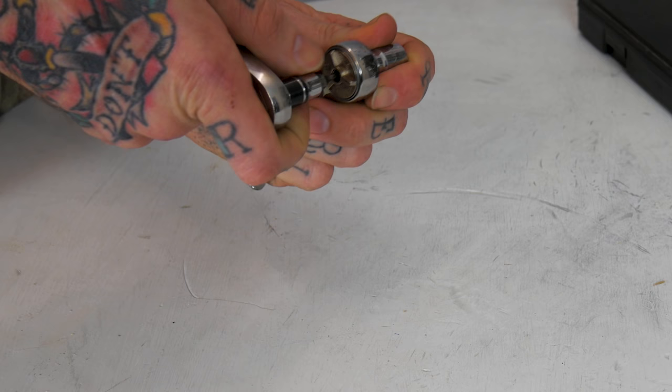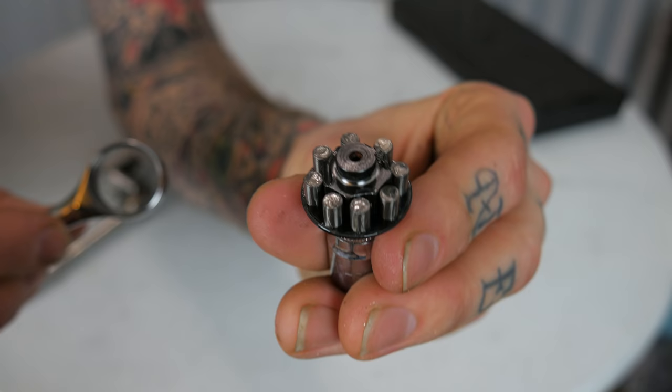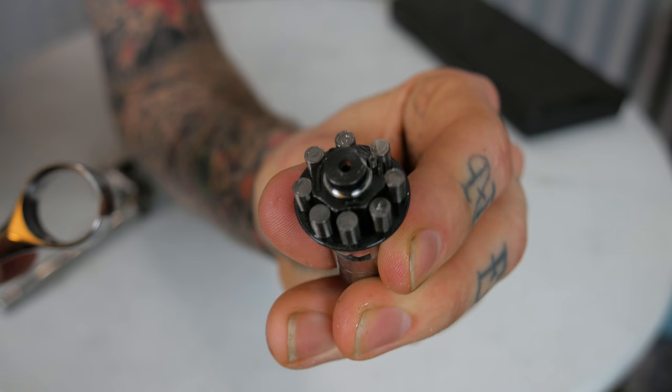So let's go ahead and pop this thing open, take a look at it, and I'll let you know what I think about it. This isn't a full product review, it's just taking a look at a new product. Disassembly on this quarter-inch version is as simple as the T8 Torx in the middle. Go ahead and loosen that up, take that out of there. It was a lot easier to remove than I expected. So upon disassembling this thing, I broke it down to its core components. At the heart of it, it is a Sprague design type ratchet.